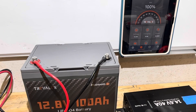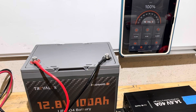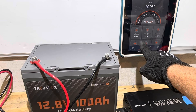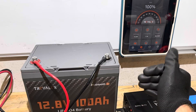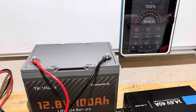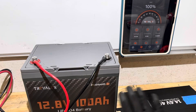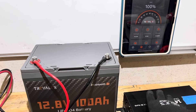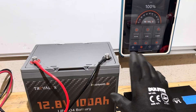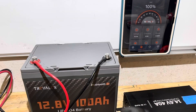I'm going to run the capacity test on this battery first, so let me top it off. I previously charged it 24 hours ago, so I'm going to make sure it is completely full — I'll top it back off. We'll check the Bluetooth and watch it charge and see the cutoff voltage, and then we'll have the indicator turn green once the battery is completely full. The battery has completed charging going by the indicator light on the charger. It stayed at 14.6 for quite a while through the whole constant voltage taper of this charger, which is a good sign. A lot of these batteries drop out due to a high cell, but this one stayed there for a while and let the charger taper all the way down. Good sign to start with.